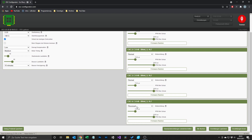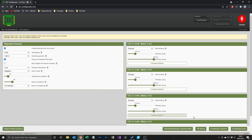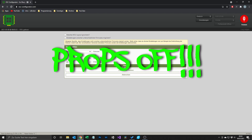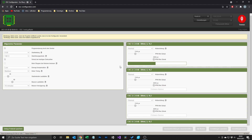In my case I won't migrate the settings to the new firmware, so I remember that ESC 4 is in reverse. Before we flash, check your target here and also check the target in the configurator settings as well. In my case it's CH40, so I will write to this target — you select the target which you have. After that you choose a version of Project Blue Jay and you choose a PWM frequency.